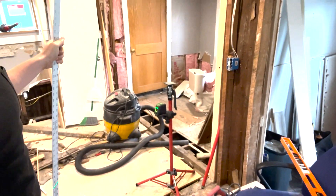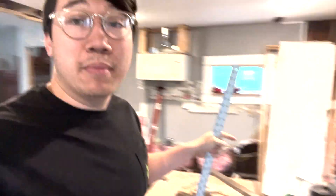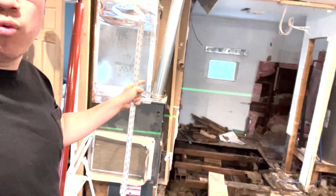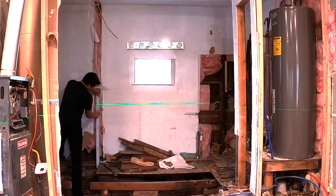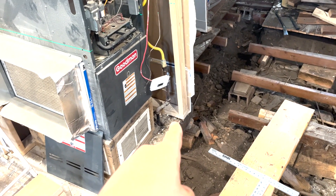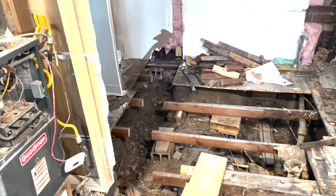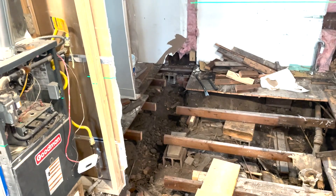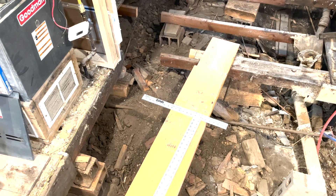So I got a plan. I'm going to use this T and measure how high the laser is over here, because this is where I'm measuring from. Then I'm going to go to this back wall and put a mark exactly where it should be based off the measurement on this T. So the consensus is right here in the middle we're down by a half inch. And over there we're actually only going to be three inches above the sill. So we'll actually notch quite a bit out of this 2x10.